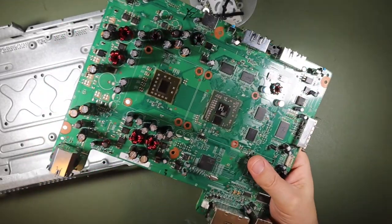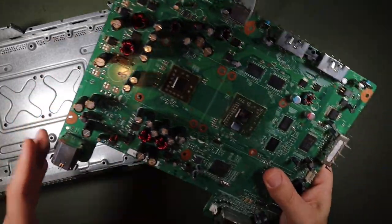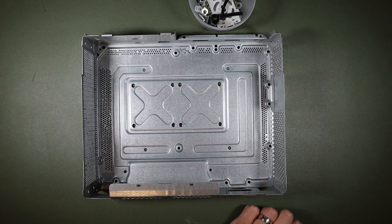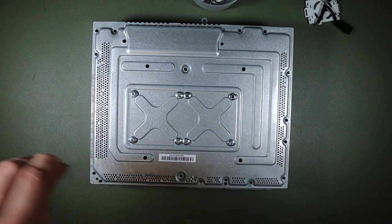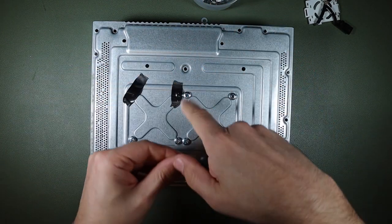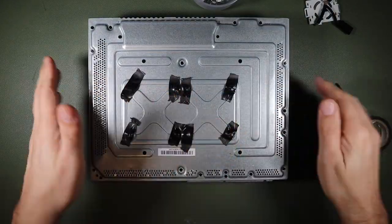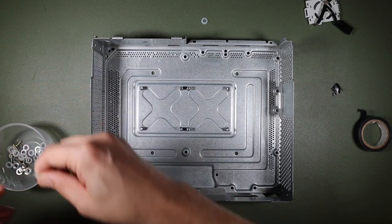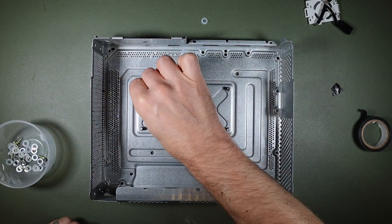A couple of days have actually passed. The weather is terrible — blowing a gale off the North Sea right outside my front door. What I need to do now is get this printed circuit assembly mounted back in the metal enclosure. I'm going to position the screws and tape them in place — holding each one individually with a little bit of tape — so that I don't bring the other pieces of tape along as I tighten each one. I think we need three metal washers and one nylon washer on each screw — that's what I've come up with just by measuring.